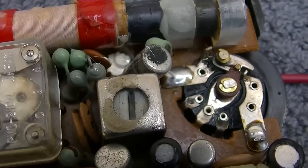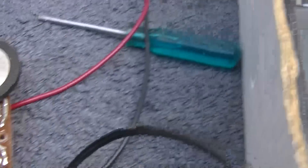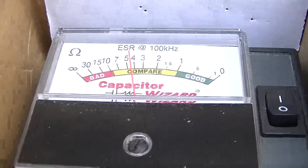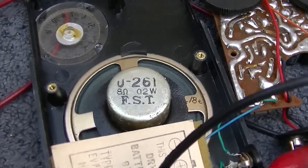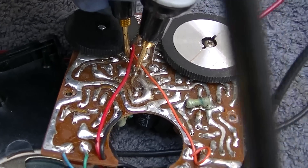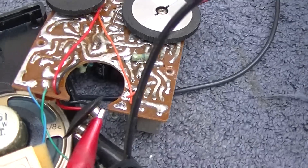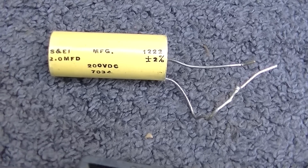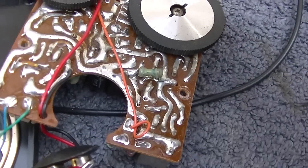Let me check this and watch it make a fool out of me. I'm about to terminate the virginity of the radio here — okay, it's been popped. That one I said I thought was it is completely open — nothing. The bigger one here is measuring about 8 ohms ESR, which is acceptable for this. The other big one is measuring 4.5 ohms — these are the ones that would cause bad bass response. Wouldn't want bad bass response on that big speaker. The volume control coupling capacitor is measuring 7 ohms — replacing it wouldn't affect performance one bit. So just the AVC filter is open.